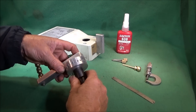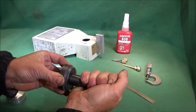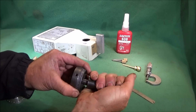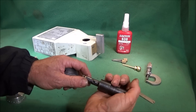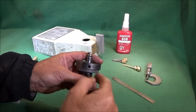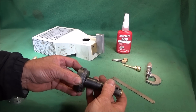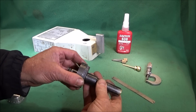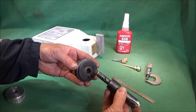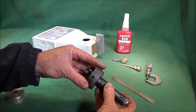If you saw the video on making this handle, you'll remember that when I put this ring on the back of the mandrel, I had a pin that goes down into a hole with a grub screw. The pin located in a hole on the back spindle, then I assembled the whole lot with Loctite 638 and screwed the grub screw in. Since then I've found the pin and grub screw are completely unnecessary — Loctite 638 alone will lock it on perfectly and it won't move at all.